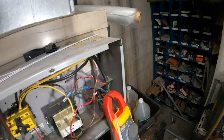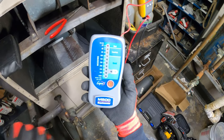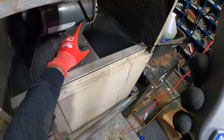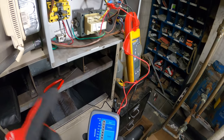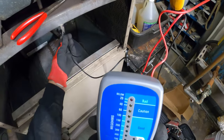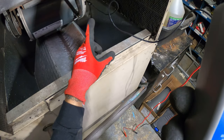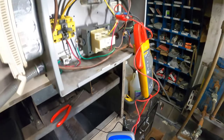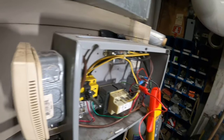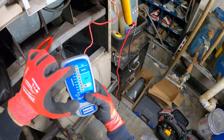So these are the two wires going to the motor — the third wire is ground. Typically when you do an insulation test on a motor, you want to check the terminals at the motor itself and not the wires, because there could be a short in the wires. But there's a good chance that motor is bad — we tripped that breaker. What I do is put one leg on the casing of the motor and then check each wire going to it.